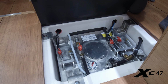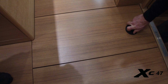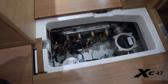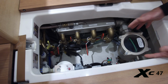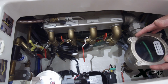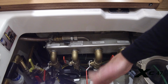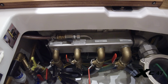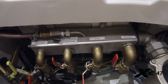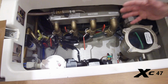Another tank, this is diesel. In here is a very interesting area with only one big water intake, one filter to keep clean. The water is led through a manifold, making it possible to open and close the different installations, such as generator, aircon, water maker, or whatever. Super simple, very, very safe and easy to maintain.